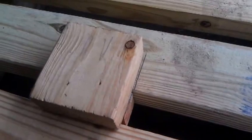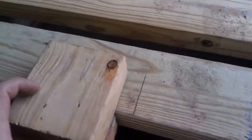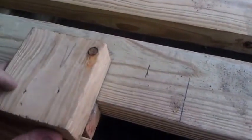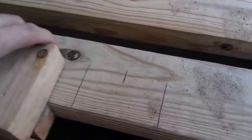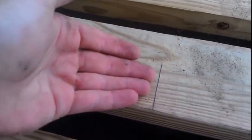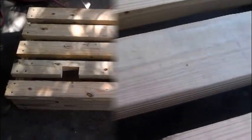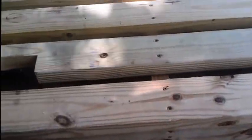Here's my other little block tool — you don't necessarily have to make one of these, it just helps me line it up. What you've got here is about two and a quarter inches of depth into this 2x4 that you're going to cut out across the front. You basically just remove all of that by cutting those lines and knocking it out with a hammer. So now we have all our screws put in, we have our two notches cut out for the plumbing, and we have our hole down here for the plumbing and the spigot.